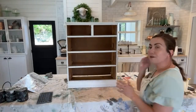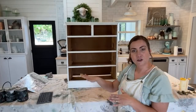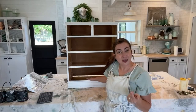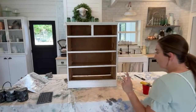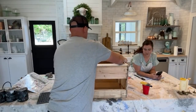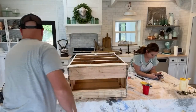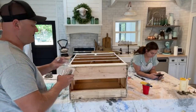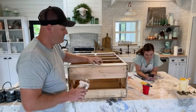All the drawers are out and Zeb is going to show you how he fixed the bottom of this dresser. These style dressers can't necessarily just have feet put on because they usually don't have a solid bottom. Zeb has a way to add wood to the bottom to make it solid, and the dresser winds up being a lot more sturdy once we do this. This morning, right before the video, I just took a two-by-six on the front and a two-by-four on the back, nailed them in from the sides and the front. I've been using paper clay to fill holes because it's so easy — you can paint it while it's still wet. It doesn't take stain, so if you want something to take stain, use wood putty.